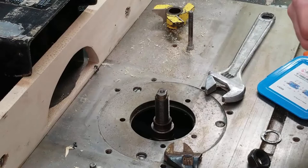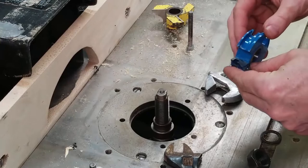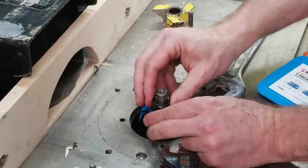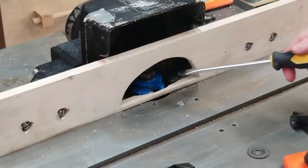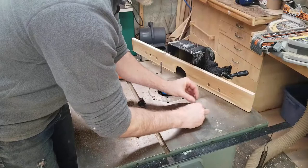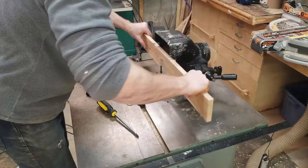The bits have an insert for a half-inch shaft but this is a three-quarter inch spindle. It cuts this way so it goes that way. The machine's been well maintained. With the shaper cutter changed, for this cutter I'm going to want to change the fence because I won't want that little bar in there. I also have to move the posts that the fence is mounted to back to the back holes to get the fence in the right position.